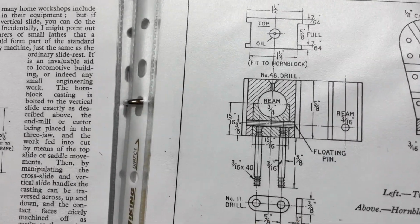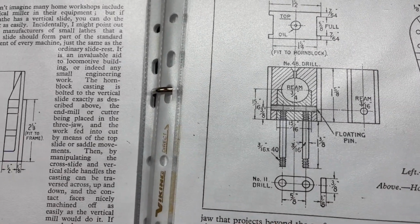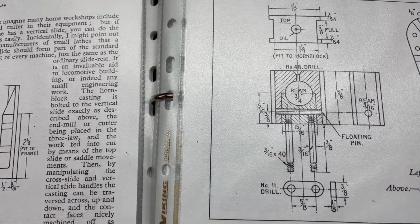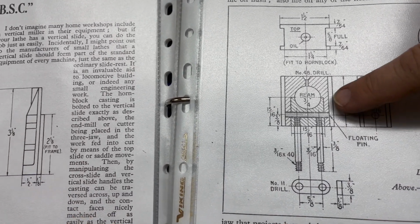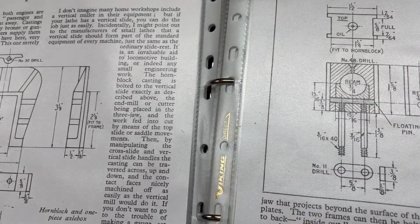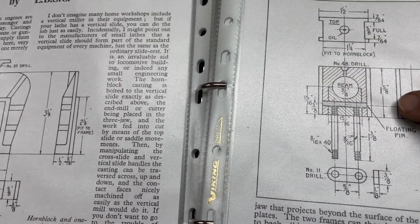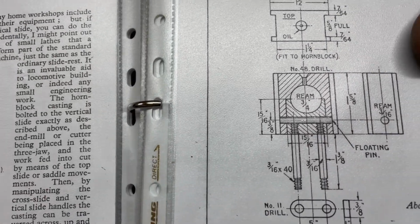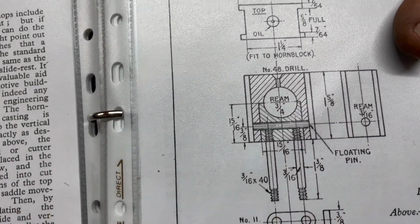A split axle box is what I think I'm going to go for, which is this. So essentially, we have to create the full-size block, and then we mill out a 15/16 by 15/16 section, and then we fit another piece in there and pin it, and then we complete the rest of the operations. So, let's get started.